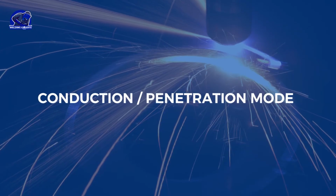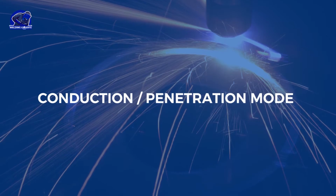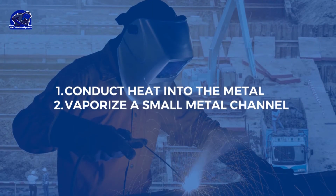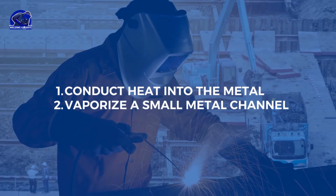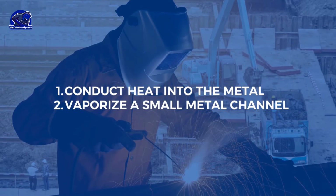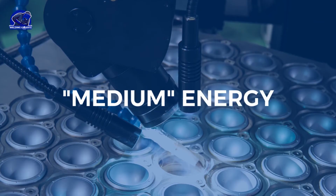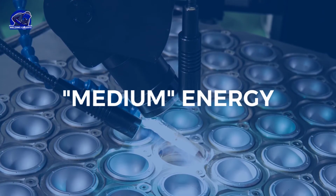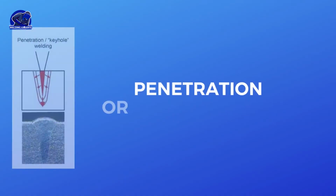Conduction and penetration mode. This may not be recognized as one of the modes by some. According to them, there are only two types. Either you conduct heat into the metal, or you vaporize a small metal channel, which allows the laser to penetrate. In contrast, the conduction and penetration mode uses medium energy and penetrates deeper. However, the laser is not strong enough to vaporize metal like in the keyhole mode.